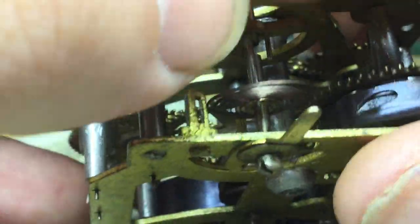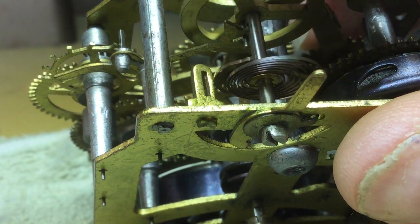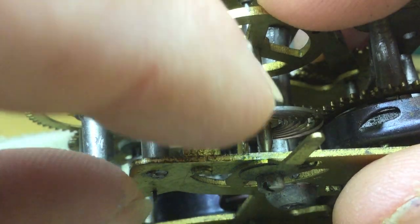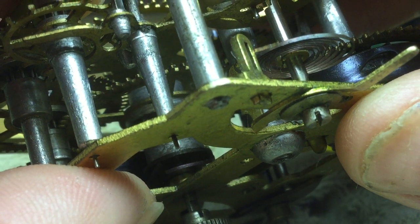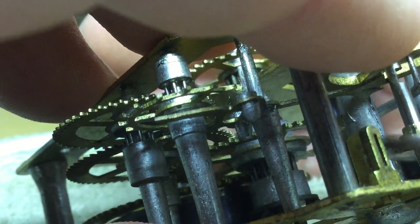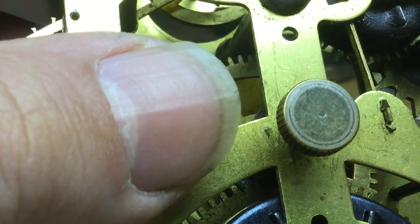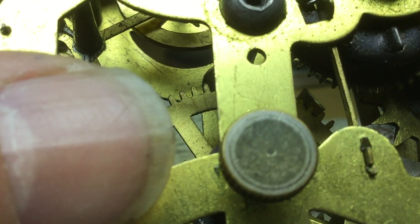Now we're going to take a look at where the banking pin is. If everything was done correctly, when you turn it around it's going to go right back into the slot. Now you can see the end of the hairspring. Turn it to where the impulse pin is pointing directly at the escape wheel arbor and gently tease the hairspring a little bit — it looks like we have it in about the right spot, just a little bit sticking past the stud. Turn the balance wheel back until we can get the end of the hairspring started into the regulating lever, using a small screwdriver to line it up.